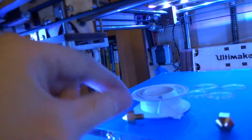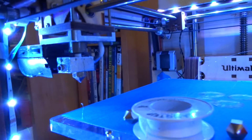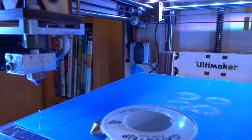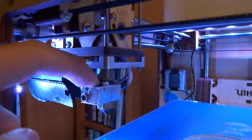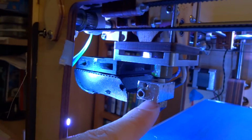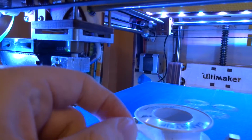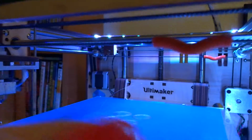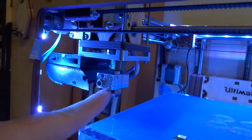That's a top tip. And then if you can find this, I mean, it's readily available in all hardware stores and plumbers have it. They have some thicker ones, this one is 0.075 millimeters in thickness. There is one that is 0.1 millimeter, and it tends to work better if you use the one that is a bit thicker in this part here. So, top tip, use Teflon PTFE tape whenever you want to keep the leakage out. It will be better.